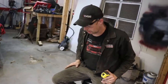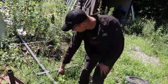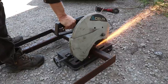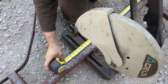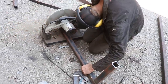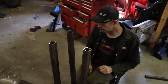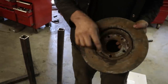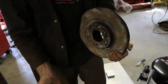This is a headache rack out of a scrap truck that came into the yard. I can see one leg here forming an L and another leg here for another L — we'll cut up the other side and we'll have our legs at 34 inches. Here's the debate as to whether you want four legs or three. This table will never wobble with three; the only thing is it might be a little more tippy. These are at least 3/16 thick. If you go with thinner metal you might want four legs, but we're gonna go with three. The bowling ball is gonna sit on the ring of the top rotor — I'm going to cut the outside all the way around and get rid of the whole hub to give me more rotation.